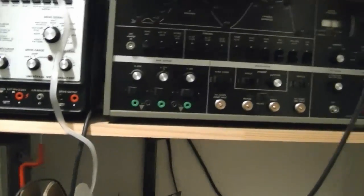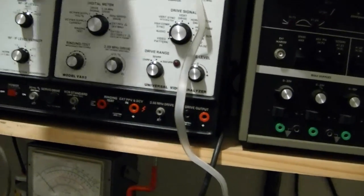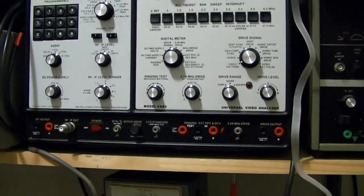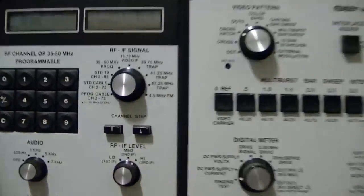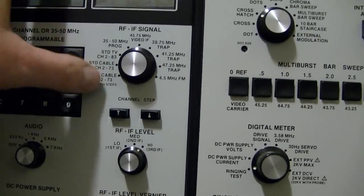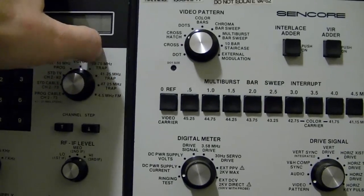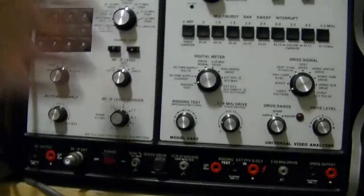When I put it in video mode and fired it up and put it on my scope, it looked nothing like a video signal. So scratch that. Next, I assumed my VA-62 could do composite video out — it's a test pattern generator, after all, or a universal video analyzer. But I don't think there's any composite video out of this either. It's RF or IF. Looking at all these modes, it's either cable or TV — full RF — or the new programmable IF mode, fixed IF frequencies, and a 4.5 MHz fixed sound frequency. So no video.